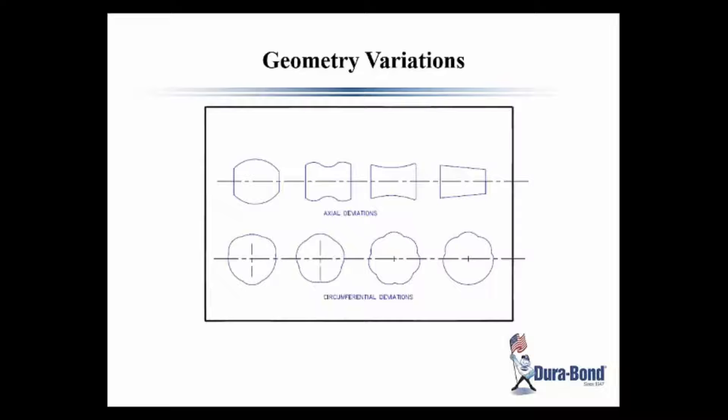This slide shows some of the anomalies that can be found in camshafts as they're polished and ground. All of these are detrimental to hydrodynamic lubrication. Many of these will increase pressure and fatigue bearings, or worse yet completely wipe them.